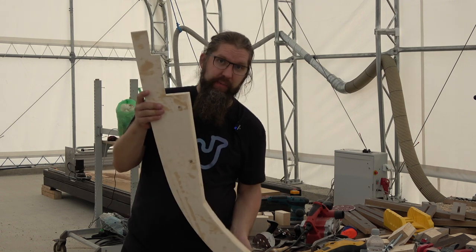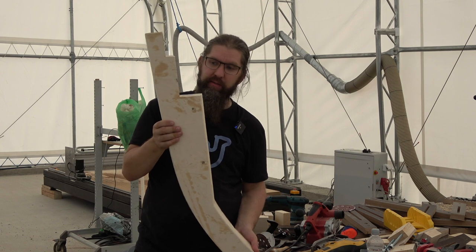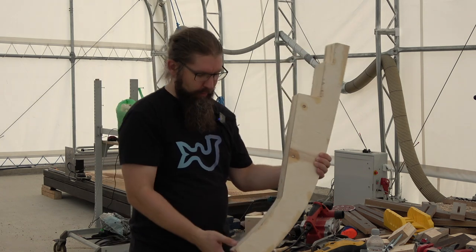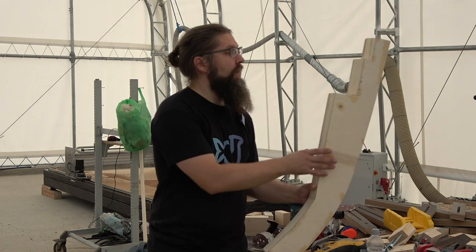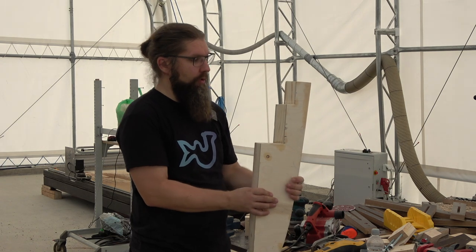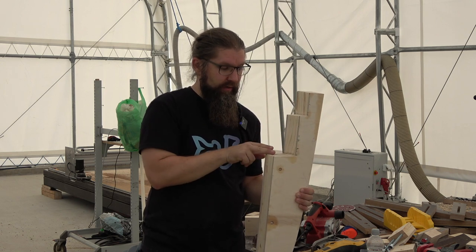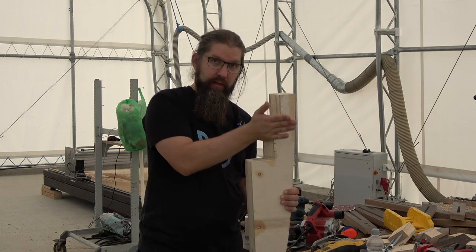So this frame piece is part of the last frame of the boat, the very transom. So the front of the boat is there, and this is the port side, I think. The frame will be like this, and it will continue like that over here. And in this notch, there will be the clamp molding, a beam that goes across the boat. So in these frames, there is a ready-to-go, very precise place for those. It is easy to laminate in here.